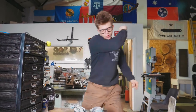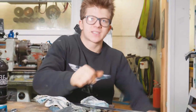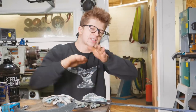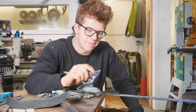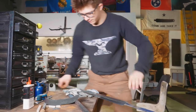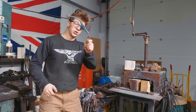The blade is at 400 grit, and holy moly, that's taken a long time — so much back and forth hand sanding. I had to go all the way to 120 right at the beginning, then worked our way up: 120, 180, 240, 320, 400 — side to side, straight along, side to side, straight along. We've got it at 400 grit, and that's all we need for a good edge on some Damascus, because of course we've got some nice twist Damascus inside here. I'm now going to put some oil on so it doesn't rust too much before the final finish.